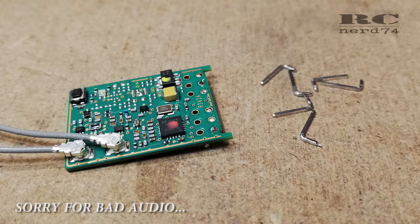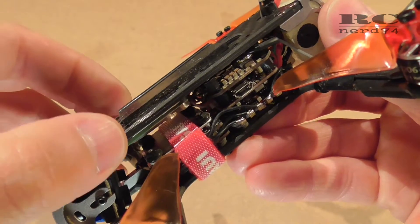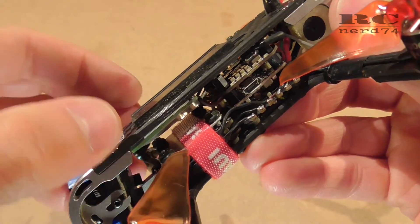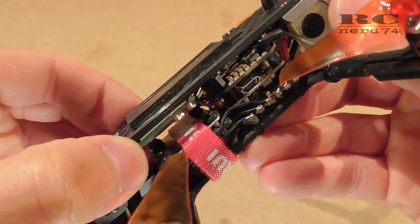This way you're able to unsolder the pins without damaging anything, so you can reuse the pins and also the pin holders and solder them back onto the electronics plate if you want to use your receiver in its original condition later.